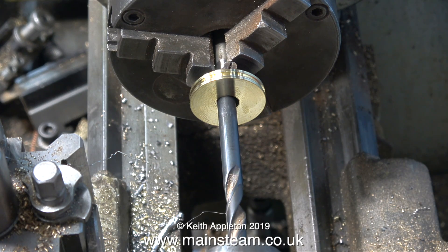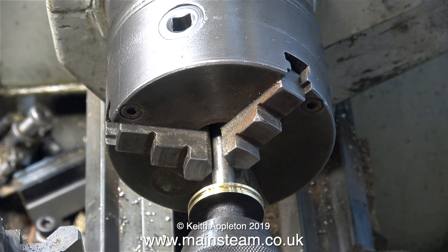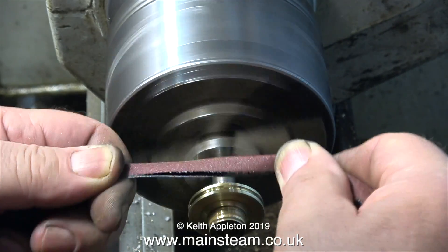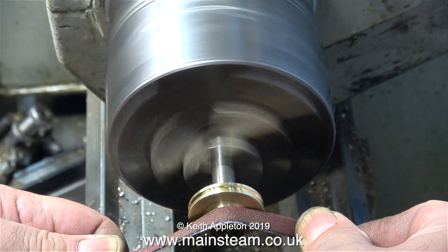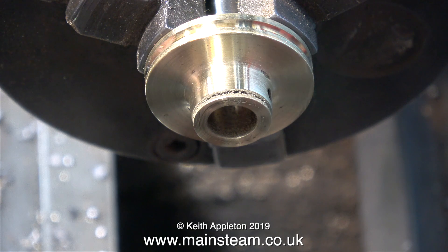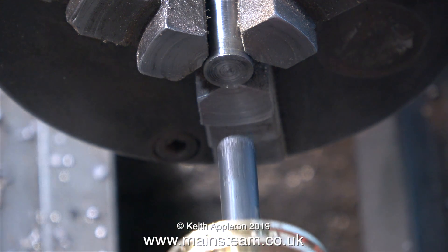Here's another top tip using the tailstock. All I do is slacken off the mandrel in the chuck and press it through with the shank of a twist drill used the wrong way round in the tailstock chuck. Then I pull the mandrel out of the chuck, tighten it up, and once again using the tailstock chuck I press the pulley onto the mandrel from the other side. I'm not going to machine this side because I like the shape of it — I'm just using emery cloth to clean up the brass and make it shine. This pulley may have started life as a casting because it's quite rough, and it took a while to clean it up, first with emery cloth and then with wet-or-dry sandpaper. It's still not perfect but it's near enough, and a lot better than it was.